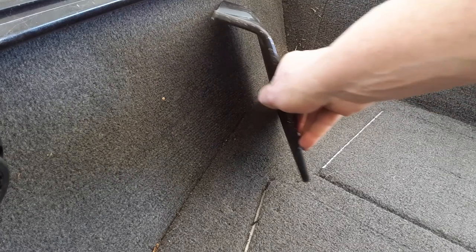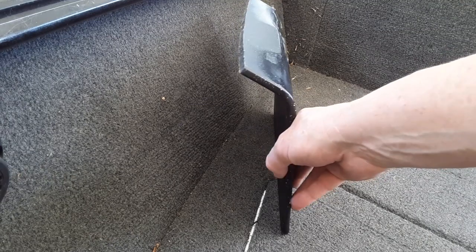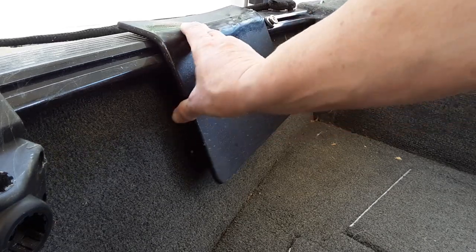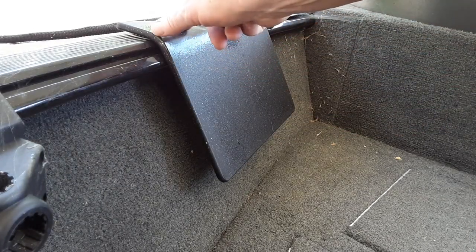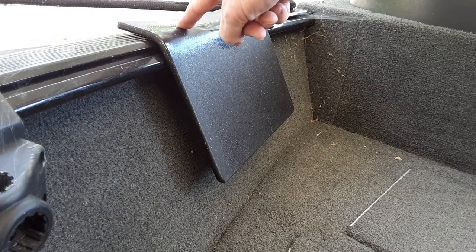Here is the piece after I've made my bend — you can see it here. Since I just did it by eye, I'm going to see how it fits on the rail. You can see there's an overlap, so what I'm going to do to make it fit at the right angle is trim it right about here, and then that's going to let me drill my holes in here for my T-bolts.